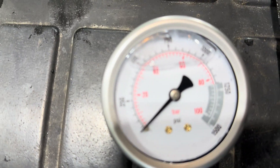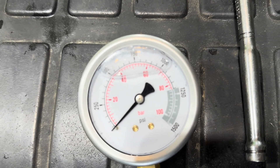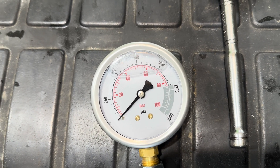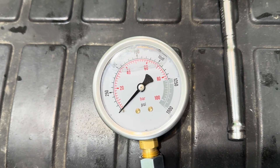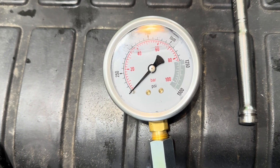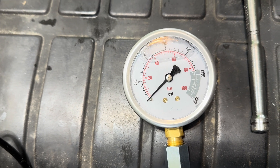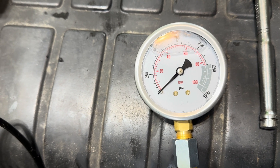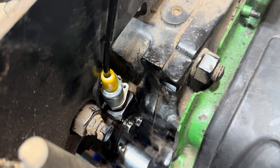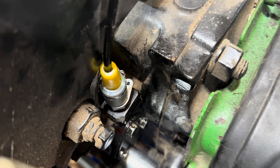You're going to look for about 200 PSI — it's kind of hard to see because it's fuzzy, but about 200 PSI at that test port. That's what the John Deere technical manual calls for. Before I fixed it, it was getting about 25 PSI — just enough to seem normal with nothing on there. It would run and seem normal at first, but when you put an attachment on, it just didn't have power, because I was only getting 25 pounds of pressure at the test port and you need about 200 pounds to engage the PTO all the way.